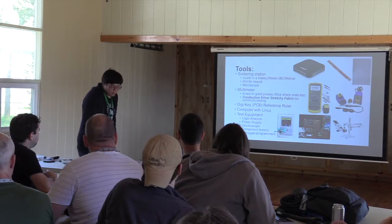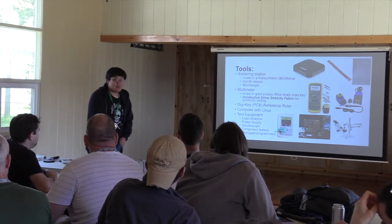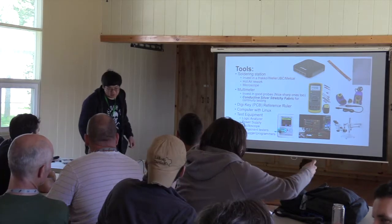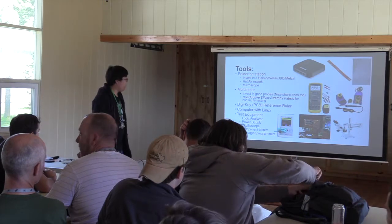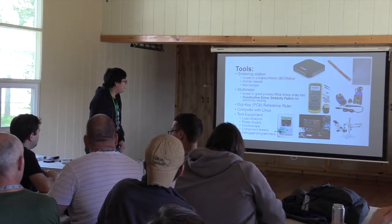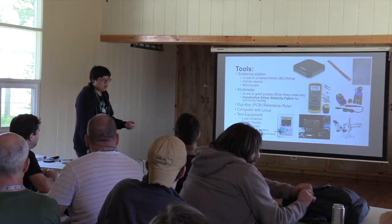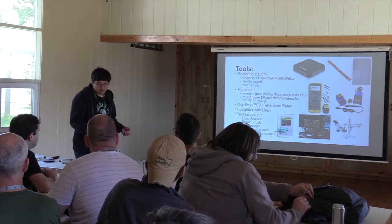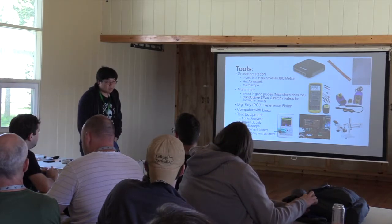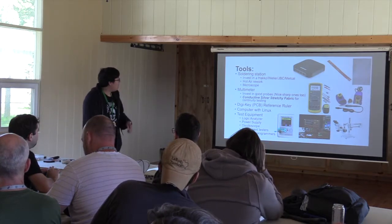And having a computer with Linux is nice, or Mac, because if you need a dd image from an SD card or eMMC card, it's really nice to just use that instead of dealing with Windows not having support for some of those file systems. Because most of the stuff I do, I'll be extracting BGA eMMC chips and then wiring 40 gauge wire exposed and routing those out to like an SD card, because you can actually read most of those eMMC cards as an SD card with just one data line, clock, and command line. So just a nice note.